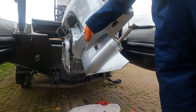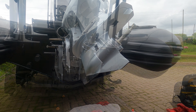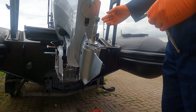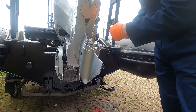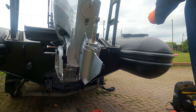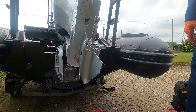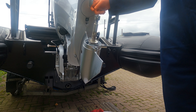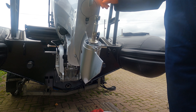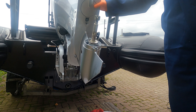Now we can get to these bolts — two here and two on the other side — and we should be able to lower the lower unit off to get to the impeller. So now we've got the engine trimmed up and level. I'm just going to take this allen key head off this bolt to reveal a hidden bolt in there. There's two on each side, and there's one on the top which does the trim tab — I don't think that one holds the lower unit on. So we'll take out the five bolts.